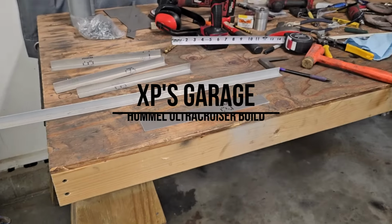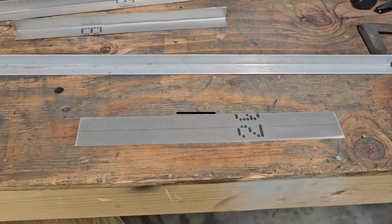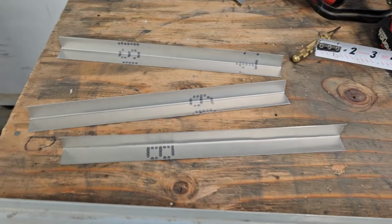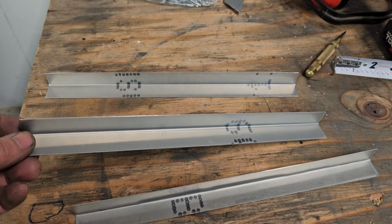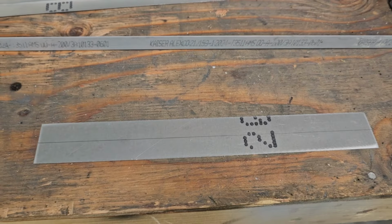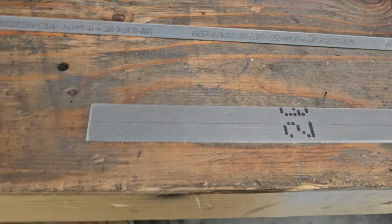While I'm waiting on my Clecos to get here, I decided to go ahead and work on the Aileron Bellcrank assemblies that go on the end of the outer nose rib. So what I need is some 4 pieces of 3/4 angle made out of 6061 .125. So cut some strips out, just simple as marking the center line, and then we'll bend it up.